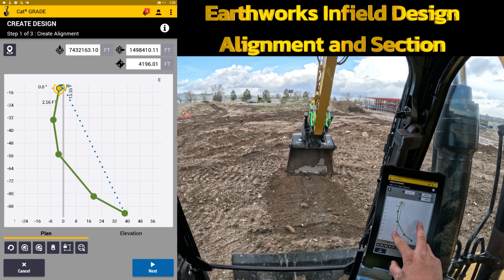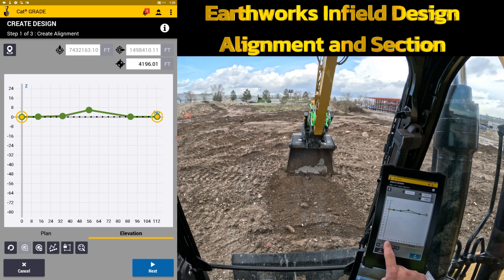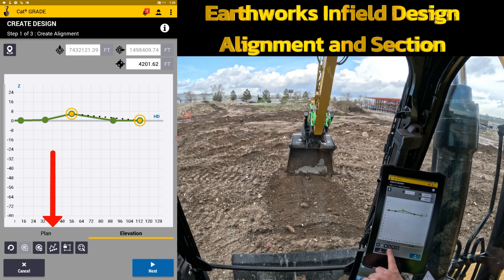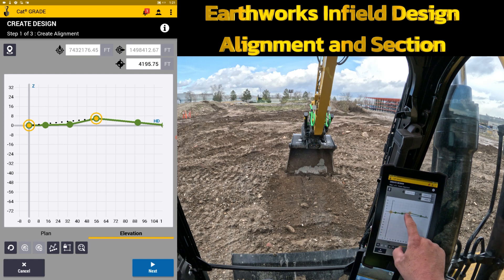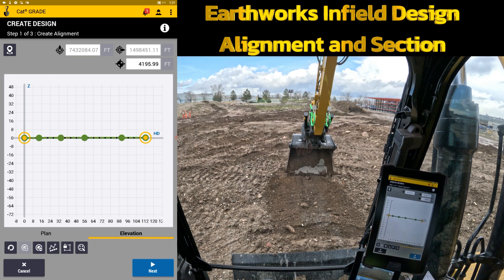If you feel like everything is built right but you don't like the elevation, you can come into elevation view. You can select the yellow in between two different points to correct that elevation without manually changing it. Pick those two points and there's an icon at the bottom — it has dots kind of up and down on it — touch that and it straightens the elevation in between those two. You can also manually change those elevations the same way. If you needed to take that high point out and just use beginning to end, you can do the same thing. I'll leave that in there so it shows a little differently on the main screen. Step one — my alignment's good. I'm going to go to the next step by hitting the blue button.